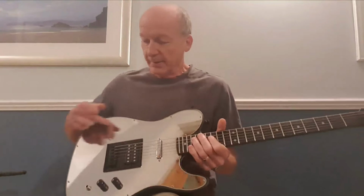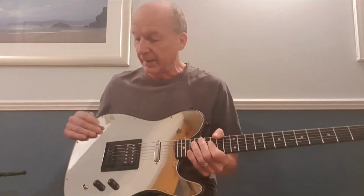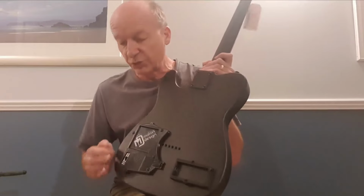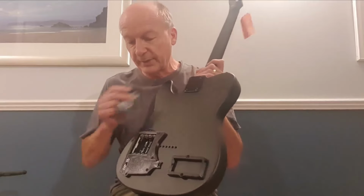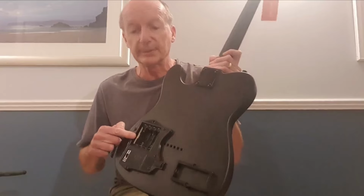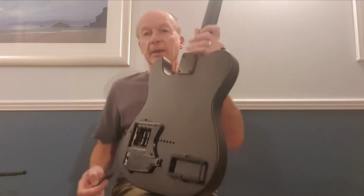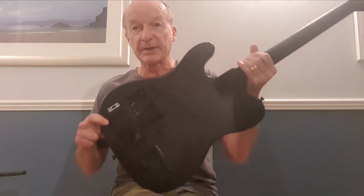It's been modified. As per my previous modifications, the guitar body is hollowed out on a CNC machine with an LED strip fitted around the inside perimeter. And there's acrylic mirrors, one on the inside and one on the outside. And it's all powered by an ATmega chip that's inside this housing here. And we've got batteries. A battery compartment here and a compartment for the control, which I'll show you in a moment. Okay, so yeah, great guitar, and let's get some batteries in this.